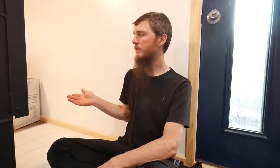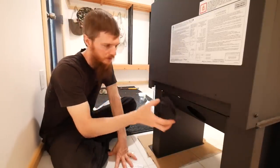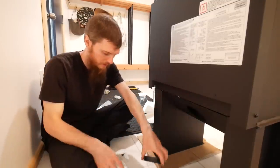This wood stove can be set up to use room air or draw air from outside for combustion. For mobile homes, it's usually required to draw air from outside. We also feel more comfortable with it not using our indoor air — just pulling air from outside and leaving us oxygen. To draw outside air, there's a little ring you attach at the bottom, and we'll run a flex duct out to the wall.